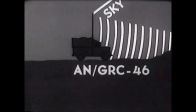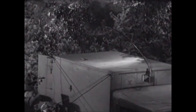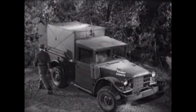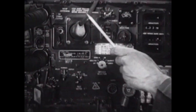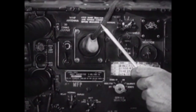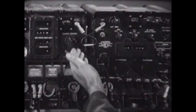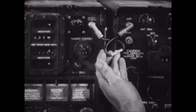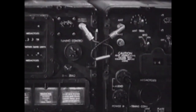Some of the capabilities of the AN-GRC-46 are determined by the antenna system. The antenna provided is a five-section, 15-foot whip, mounted high on the outside front panel of the shelter. Inside, it is connected directly to the transmitter. When only one antenna is used, there is an additional interconnection between the transmitter and receiver — a jumper that allows the antenna to be switched from the transmitter to the receiver and vice versa, so the one antenna serves in both transmit and receive.